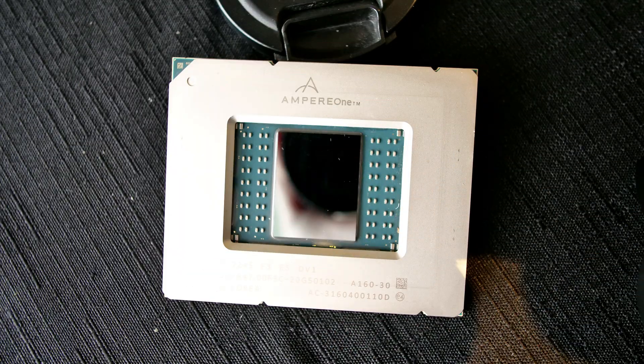This is a picture of a chip I actually got to see at Computex last year — the 192-core version with Ampere 1. The shim around it is actually quite massive, and under there are chiplets. Under that shim is a number of chiplets for PCIe and DDR. If you need more memory channels and can afford fewer PCIe channels, you can replace some of those chiplets. Going from TSMC N5 to TSMC N3 means a completely different core for the 256-core version, but the chiplets will be a combination based on what's already been designed.